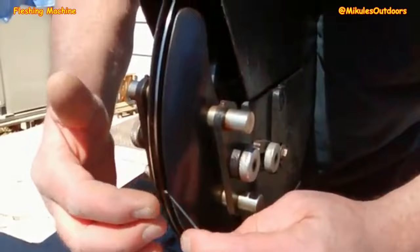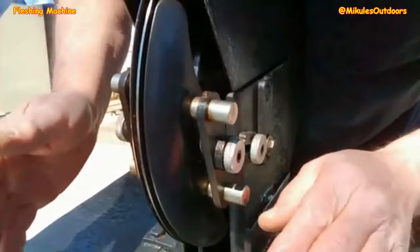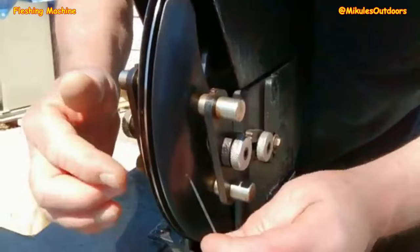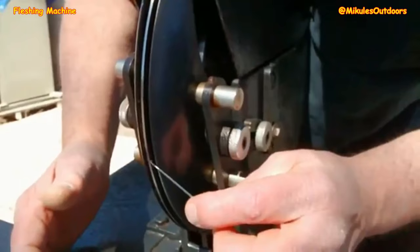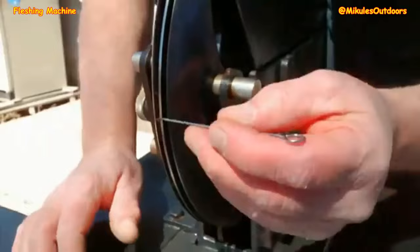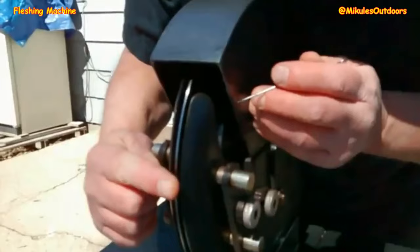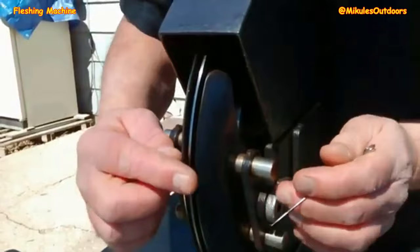You adjust the guards front or back to expose or cover more blade. You adjust the guards inward by loosening up the set screws on this specific Dakota machine — other machines are going to be a little different. Initially, this right guard is even with the blade. The left guard should be back about 3/16ths to 1/8th of an inch, exposing that part of the blade. Then you determine up here how much of that lip you want to bend up. You don't want to bend it up too much — you don't want it too aggressive, maybe about 60 degrees. You may even have to push it down a little bit. That's the secret right there. The biggest secret is you have to get your experience and adjust what works for you.